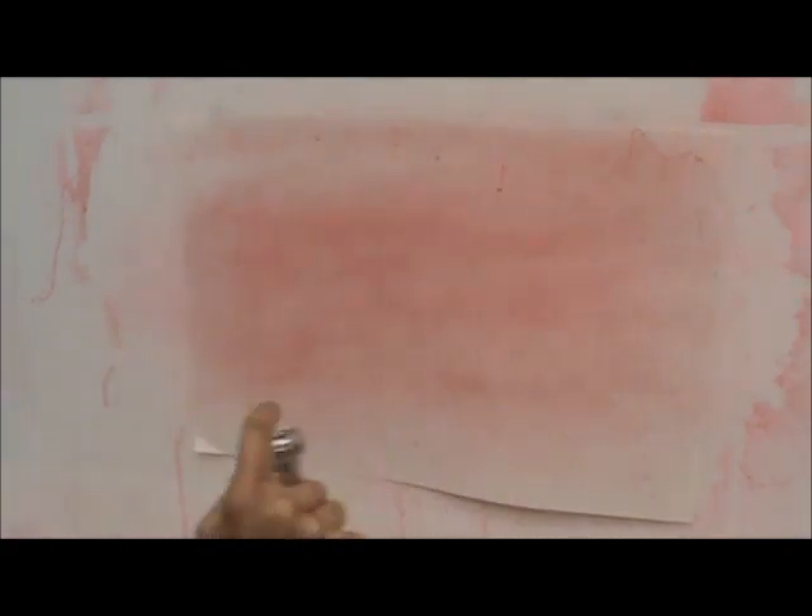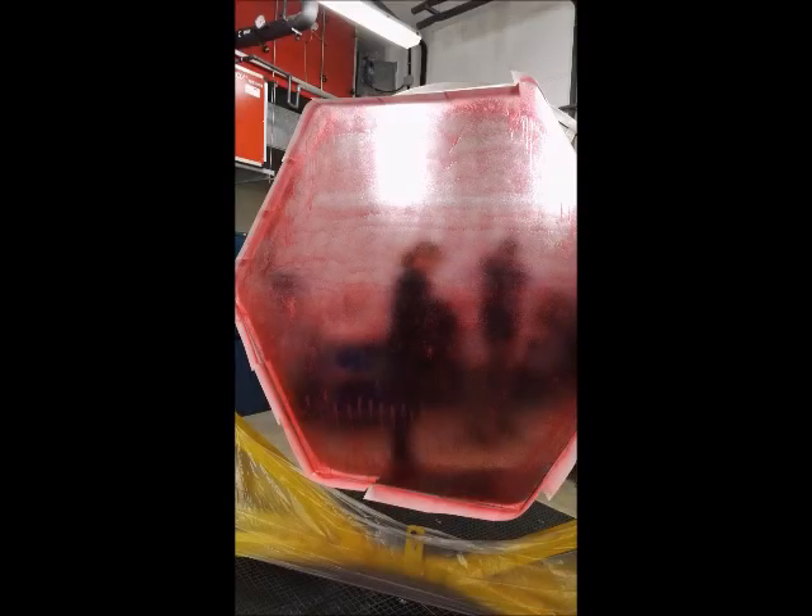On the contrary, below 40 PSI creates a less consistent spray pattern. The sprayers come with a selection of four nozzles ranging from fine to coarse. The fine nozzle creates a nice consistency and is great for smaller optics, also for the initial tack coat on vertically mounted optics because it releases less polymer, while the coarse nozzle is suitable for larger optics because it allows more polymer to be dispensed.